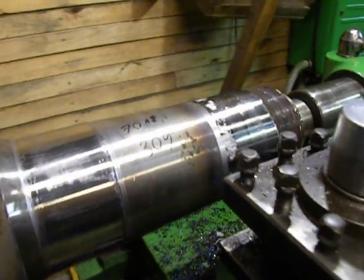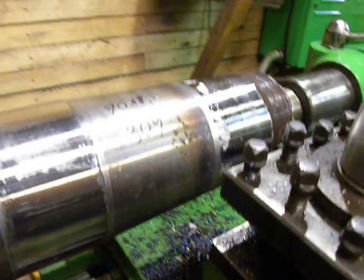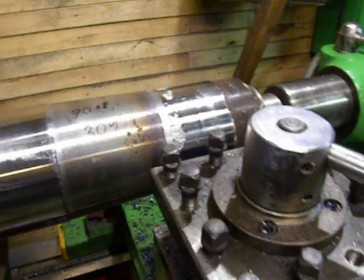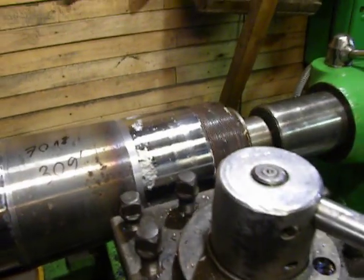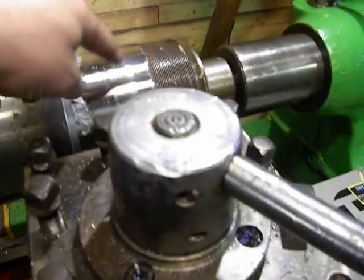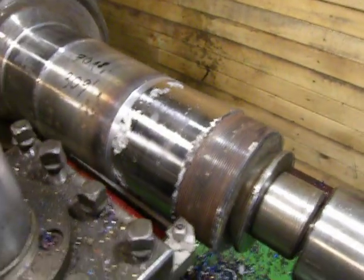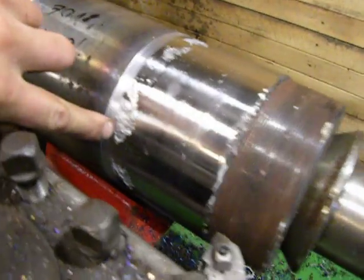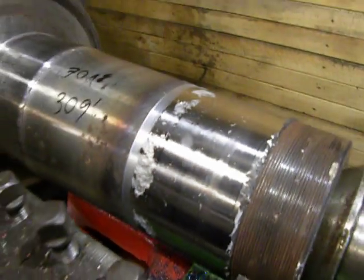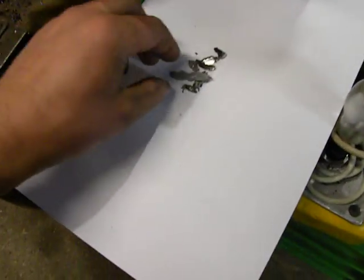What he did — he took a welding stick which is designed for welding the teeth of an excavator bucket and welded with it. And what happened over there: this weld became rigid as glass and brittle. Like you'll see here, this is a broken-out part.